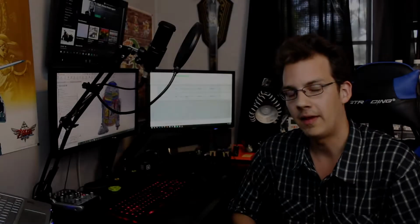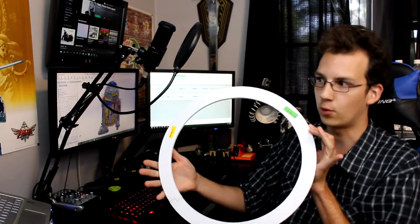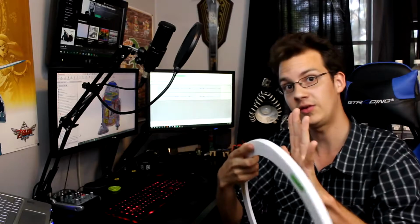If you recall in my last video, I talked a little bit about the slip rings right here that I was going to be using for the head turn assembly. So one thing I need to do for these slip rings is install all of the heat inserts so I can actually thread in the set screws that will be mounting this together into 2 pieces. Once I do that, I could have one of the big parts of the head turn assembly finished, and then I can integrate that into the main body frame of R2.